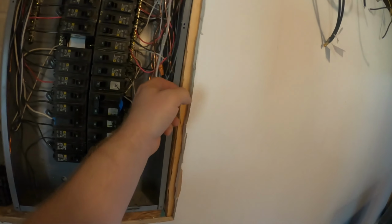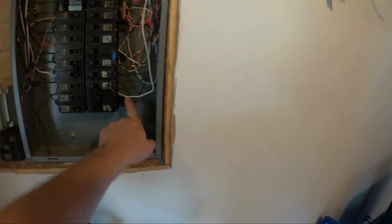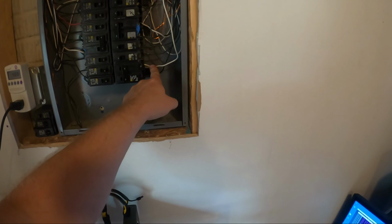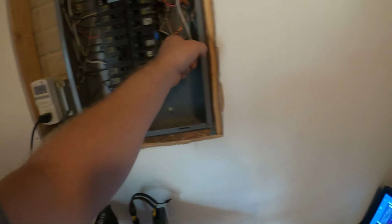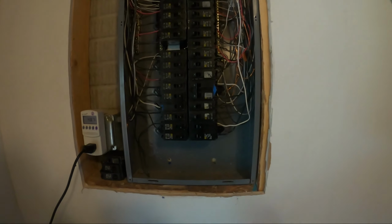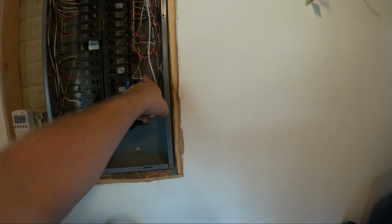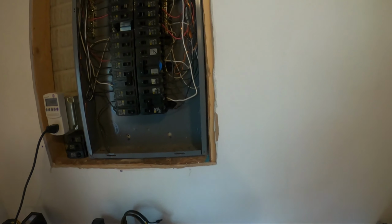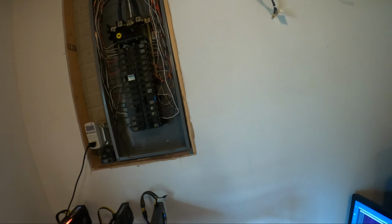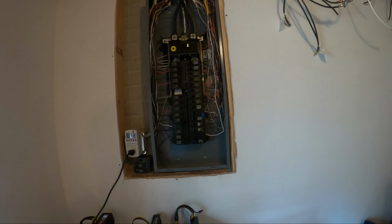Yep, all installed. So got that guy in place, black, white. When I go to the store to get the plug, I'll get some red tape, because any of these whites should have red tape around them. Yeah, so I'll probably just do, it looks like there's only those 3. One of them's mine, 2 are previous installs. So yeah, we'll at least correct it on this end, do the same thing on the other end for ours, and I'm not going to worry about chasing the others down.